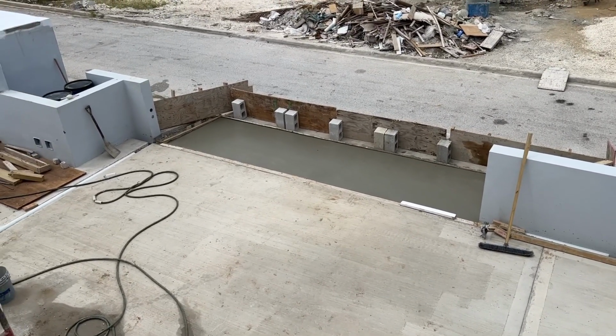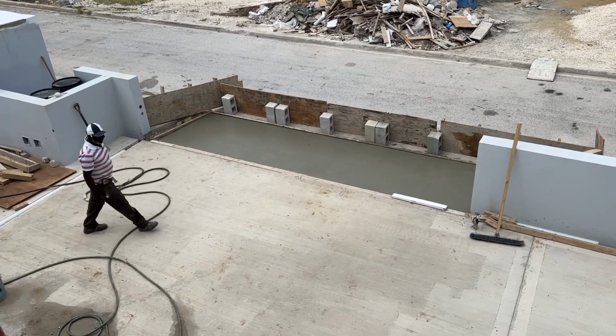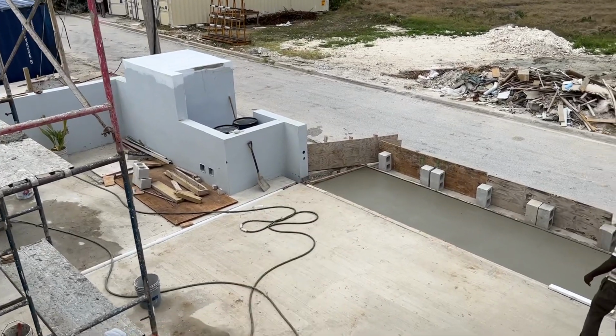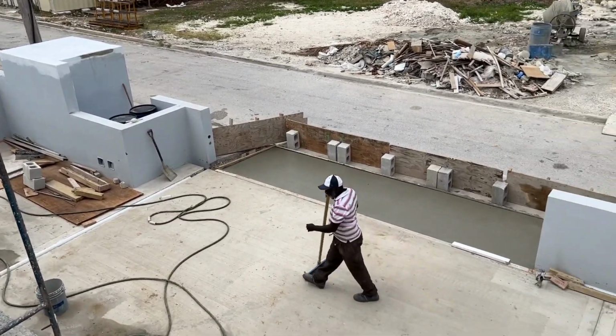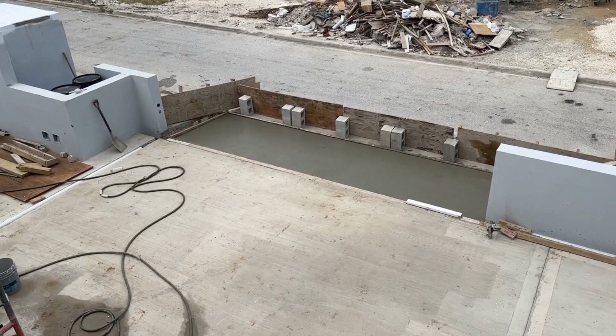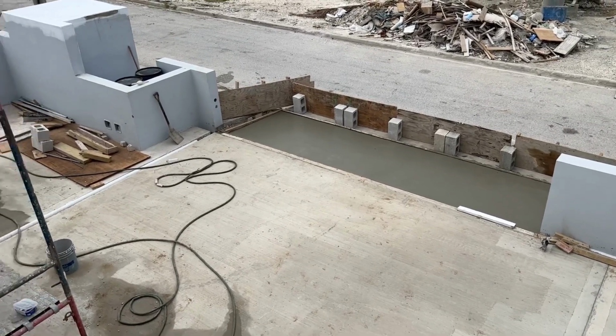There's a bit of a catch 22 there. Do we go higher or lower? We've gone lower, so it's got the run that it needs on it. We've boxed off the first 6 inches over in the corner so we can do the wipe out for the gutter. And we've gone lower because of the track that's going to go in there for the gate, so we didn't want to trap any more water in here. So fingers crossed it was the right decision.